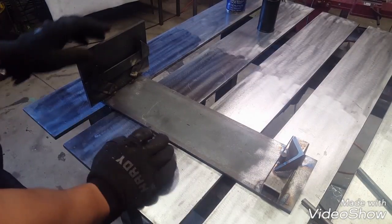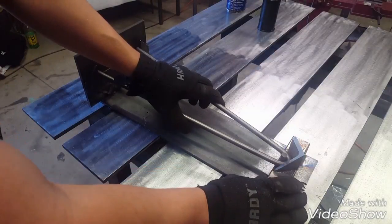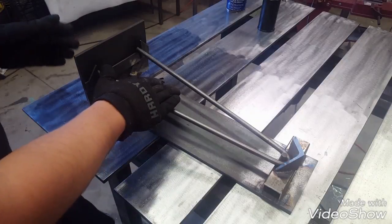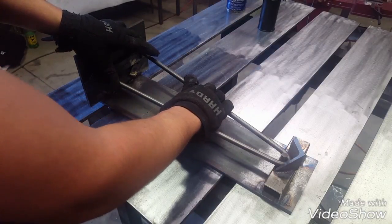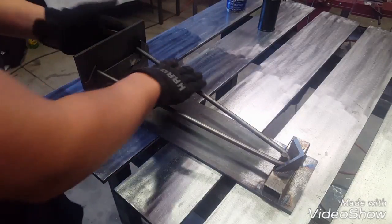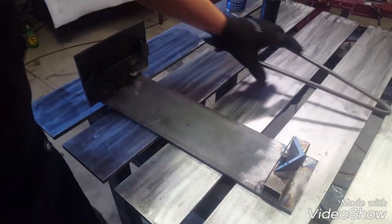So this is my dedicated 16 inch hairpin leg jig. You put your mounting bracket down through here, line it up, slip your hairpin leg that's all cut straight in there, and push it back. There's just a little bit of play, barely. I weld about a quarter of it — as much as I can while it's on the fixture. That's important because it'll keep it square and keep it from warping if you can weld as much as you can on a fixture. Once you weld that, it's going to shrink and have a tendency to pull. But there's enough there that you can still pull it off pretty easily. If you fully welded one that was in there real tight, it's going to pull wherever you weld it — metal shrinks when you weld it — so it's going to suck together. It's going to be a pain to get it out, and if not you might have to cut apart the jig or your part.